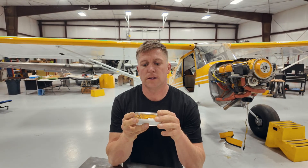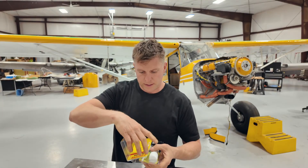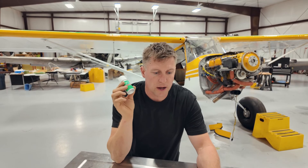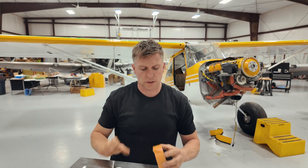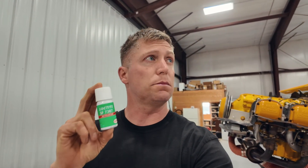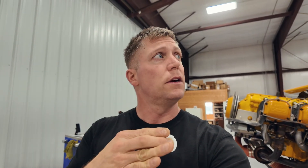I got these all cleaned up and the paint off the back of them. The next step is to take this activator — this little aerosol spray can — and apply the activator to the template holes. The instructions say the activator working life is about two hours and to avoid overspraying unprotected areas. I'm concerned about the overspray, so I'm going to mask off the top and bottom sides with tape just to prevent some of that. I only get one shot at this, so I'd rather be safe than sorry. I don't want any overspray on the wing at all.